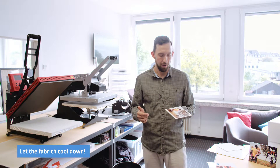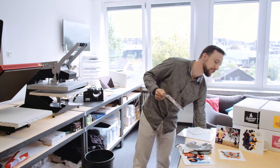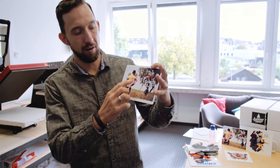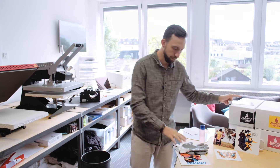To get rid of this residue, we'll have to clean the aluminium board. But first we have to wait for it to completely cool down, because we'll use standard nail cleaner and you don't want to apply that onto hot surfaces. Now I'm back — I'm holding the aluminium plate with bare hands and the gloves are put aside, so you can tell it's completely cool. I'm going to use standard nail polish remover from a local drugstore to get rid of the excess toner resin and paper resin.